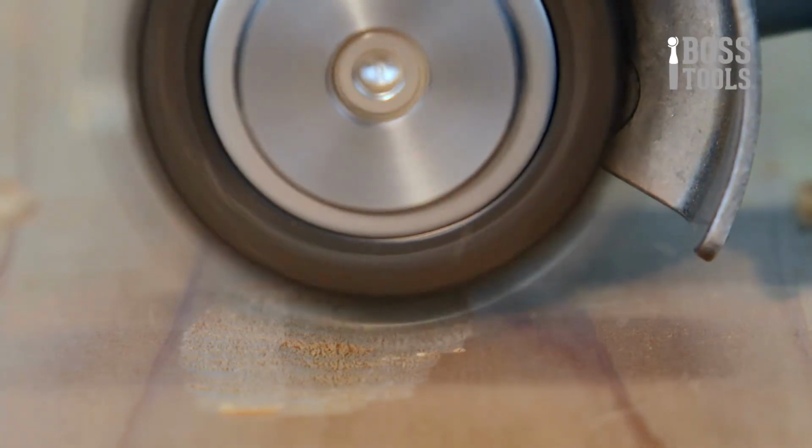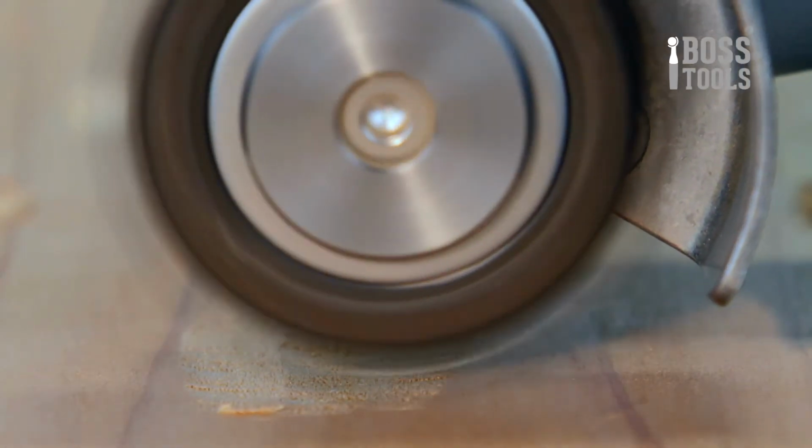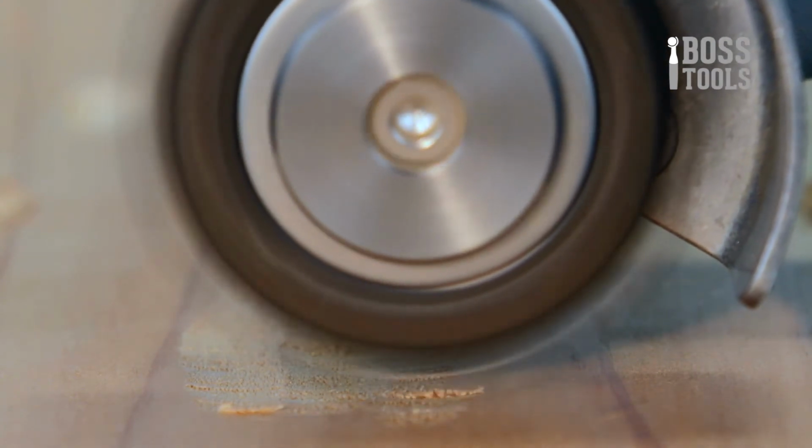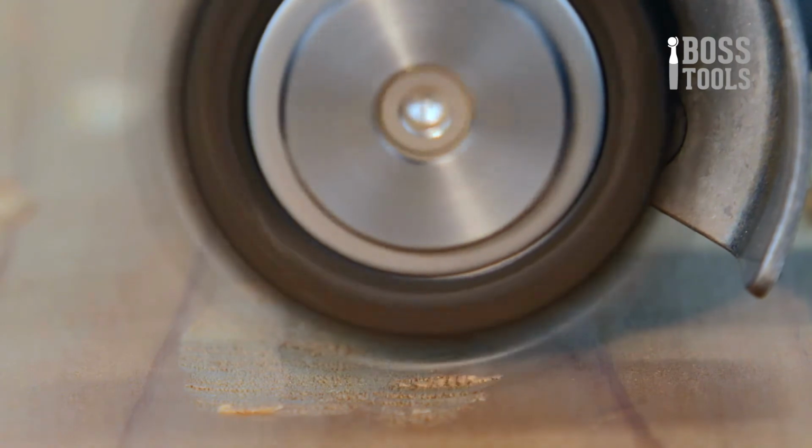It's not going to cut if you don't put some pressure on it. On a regular chainsaw blade, if you put it on a log, it's designed to cut. It's going to cut hard. Not so with a chain disc. It doesn't want to engage until you put a little bit of pressure on that blade. So it's the combination of those two things. Now you can get a lot of different options on how that blade's going to cut.